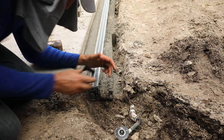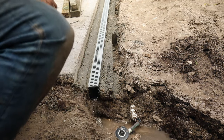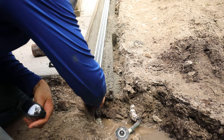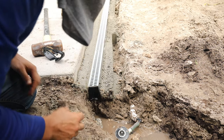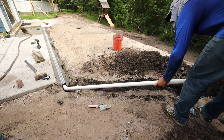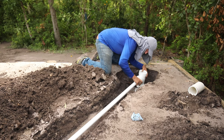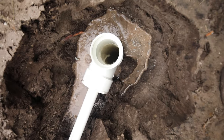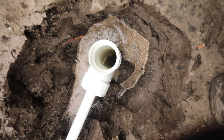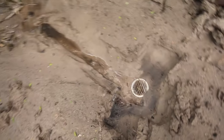I put on a flat cap while I was pouring the concrete just to keep things clean, and now I'm removing that. I ran some water first to clean the pipe out and wash away dirt before putting this cap on. Now I slide this on, then simply slide this piece in. On this end I'll assemble it first and then put it all together. With the water on to test it — everything is hooked up — there we go, we are draining water into our drain. Water's still on, coming down the drain, and here is the end of our pipe — we have a drain working.